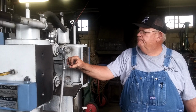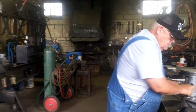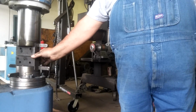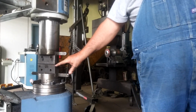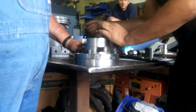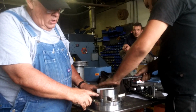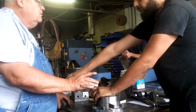How about the XY adjustment and the spherical? Okay. We have a sow block here, if you will. If you use flat dies, one of the most important things is for the edges of the dies to be aligned. So, to do that, I forget exactly when, but I know it took me 5 years to get Tom convinced to do it. We got this XY sow block where you can just tap this key out and move the top half of the sow block to align your die edges.